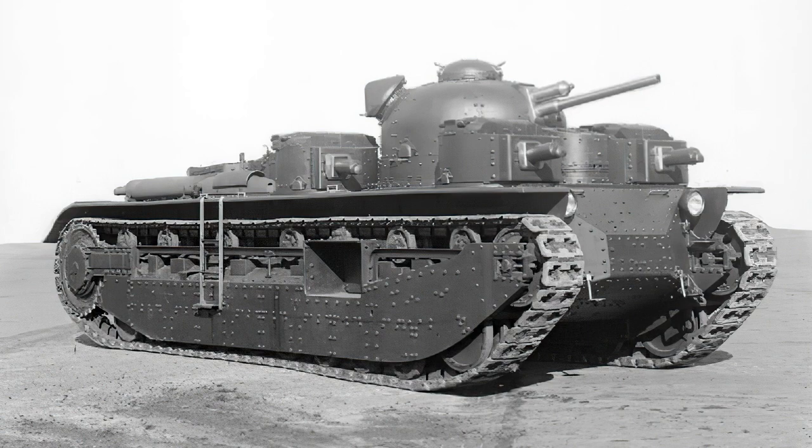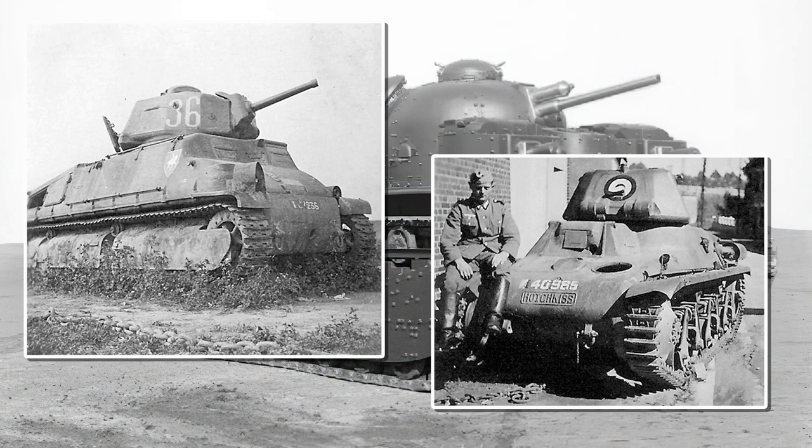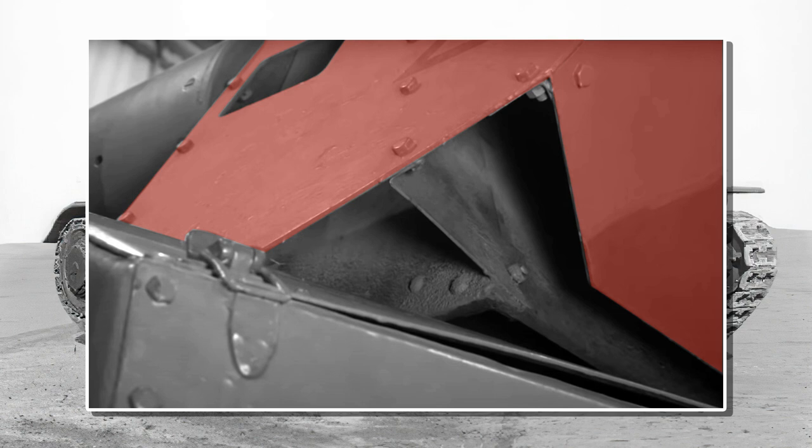The French also realized that such armor, while more effective against solid-tipped rounds, was less effective against armor-piercing capped rounds, while cast armor was more effective against the latter. The French tanks therefore kept heavy cast plate in their design for longer. This information they shared with the US but not the UK. When the UK discovered this effect, they added a spaced layer to some of the cruisers to strip away the cap before the main armor-piercing round struck the armor. The final problem was that this was only effective to a certain point, after which the corresponding bolts did not scale linearly with the required increase in armor thickness, and so the UK switched to cast and welded steel.